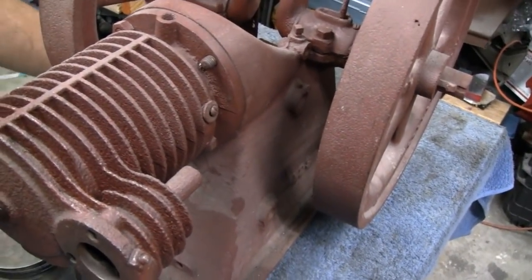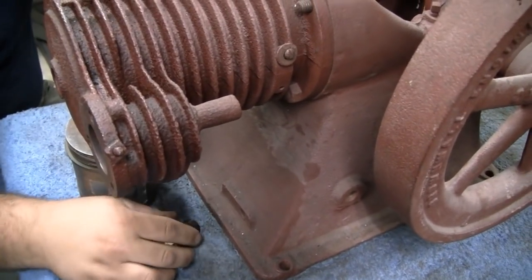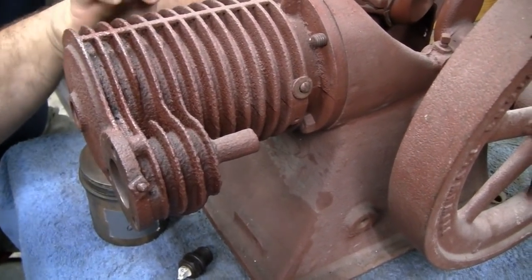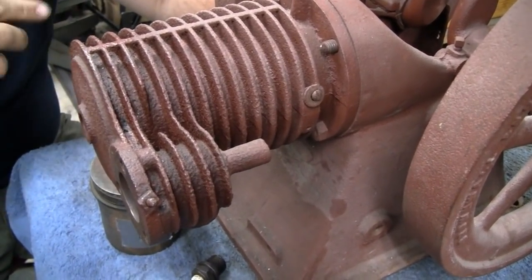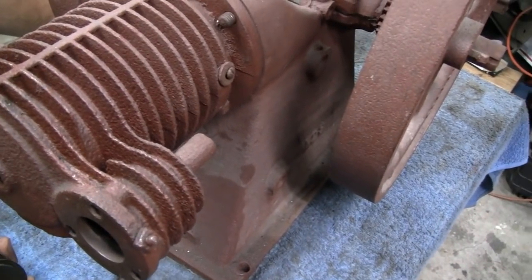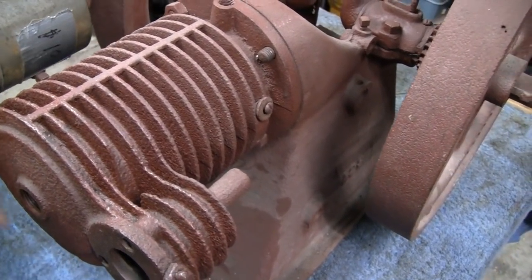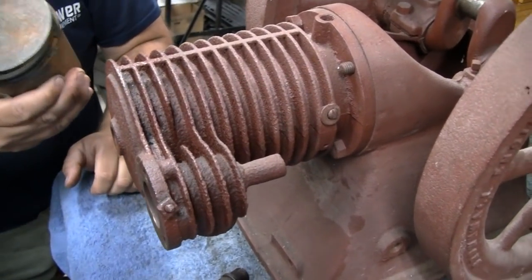Right. The problem that we may run into is that the finished cylinder bore might only go so far. Chances are it's not a finished cylinder right up to the head. It's probably a cylinder, and then there's probably a relief up at the very top, right, when they were boring it so their tool could clear. The thing is, we're going to take these rings off first, because what we don't want to do is send the piston up the bore and have one of the rings spring out in that relief area, because then we're never going to get the piston out without breaking something.